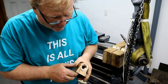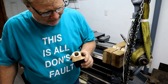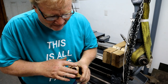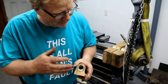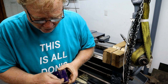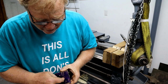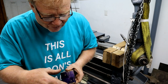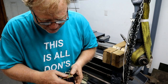All right. The saga of this thing is nearly over, thank God. Cylinder's made, cylinder's threaded. Really nice fit on that. That last pass was perfect. And now all we have to do is drill these two holes and thread them for the mount. Drill two holes in here. I'm going to put 5/16 or 3/8 set screws down into there and hit one of those flats.